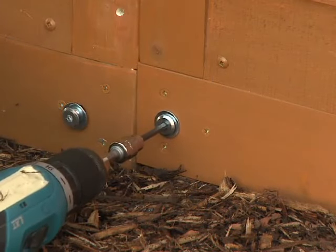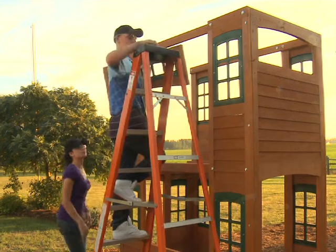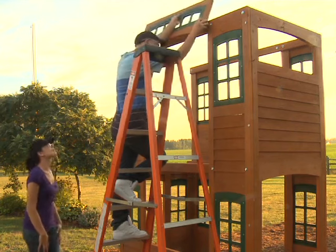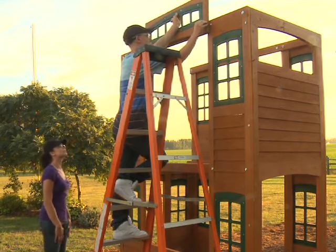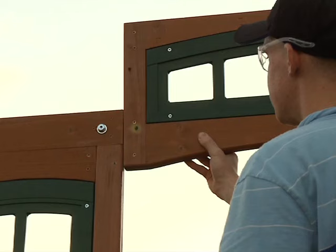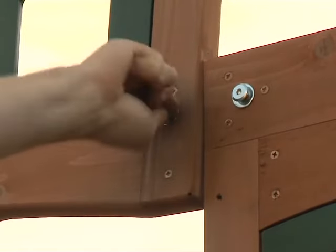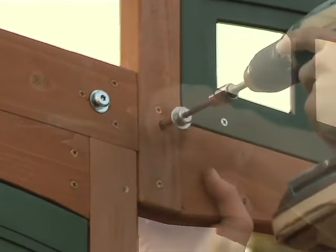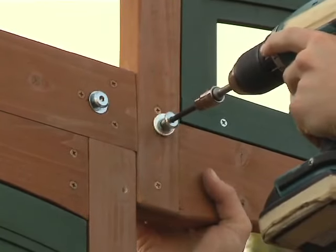the previously installed T-nuts. At the top of the assembly, above the half panel, place the 061 transom panel front between the swing and door wall assemblies so the bolt holes are at the bottom of the panel. Loosely attach to the long wall tie with two WB9 wafer bolts with 5/16 inch flat washer using the previously installed T-nuts.